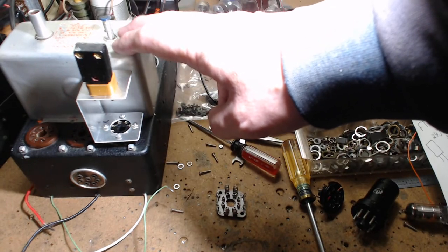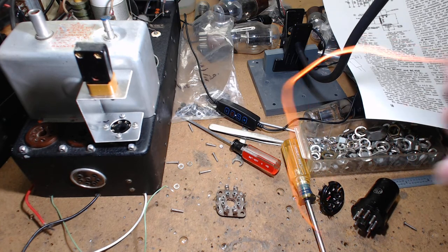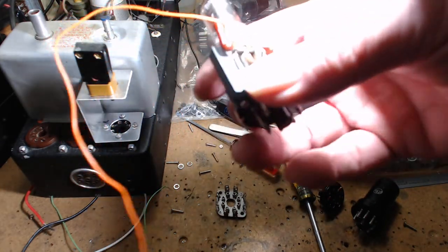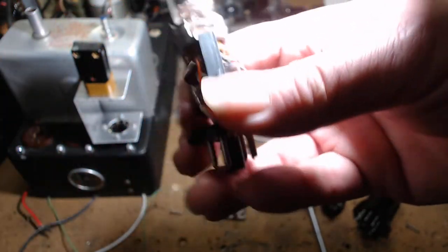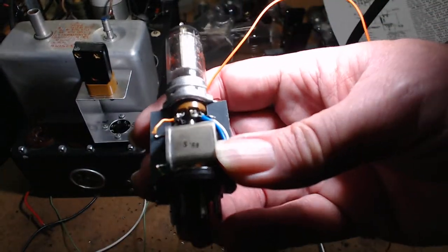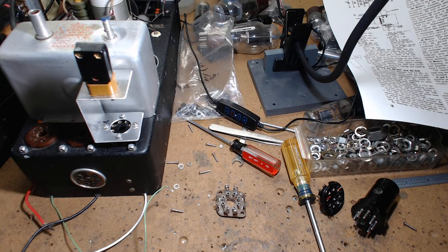ARC-5. This is a 19. I believe that the ARC-T20 is the 40 meters. A lot of numbers for me to remember. Don't forget, I'm dyslexic. Certain things I can remember, certain things I can't. But in other words, once you realize this makes a BC-454 able to transmit into a BC-453 as a Q5er without changing either radio. You take out one of the IF tubes, you stick this in, and this wire comes out. It gets the voltage from the socket. This is an antenna that goes over to the BC-453. And then you've got a Q5er.